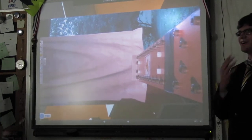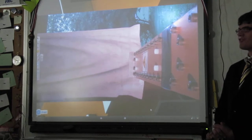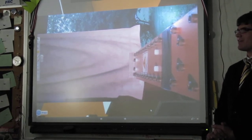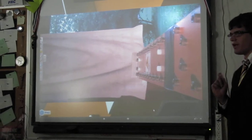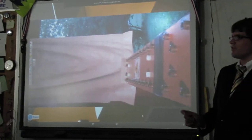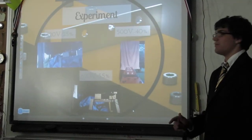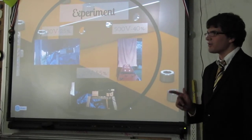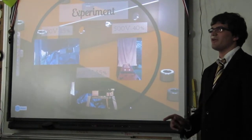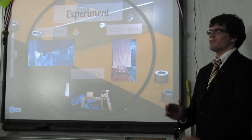Sorry about that. We had a little problem here. When we charged it up to 550 volts, there was something inside the capacitor bank, like a fine strip of wire or a tiny little ball of solder, that was sitting right next to two terminals, and 550 volts was enough to bridge the gap between that fine piece of solder and the terminal. What that sound was, was the entire capacitor bank discharging through that small point, vaporizing that connection, and making a very large noise and flash of light.